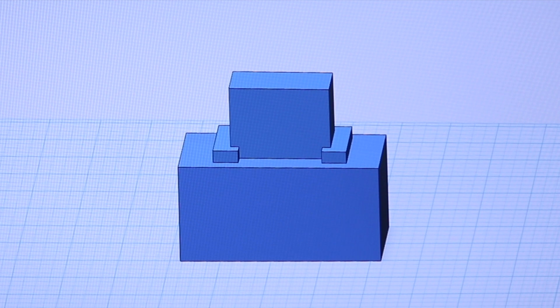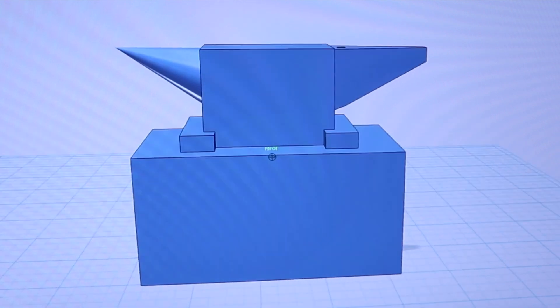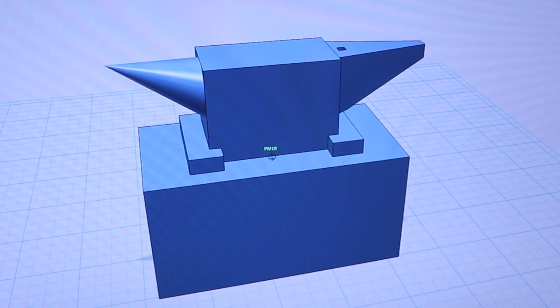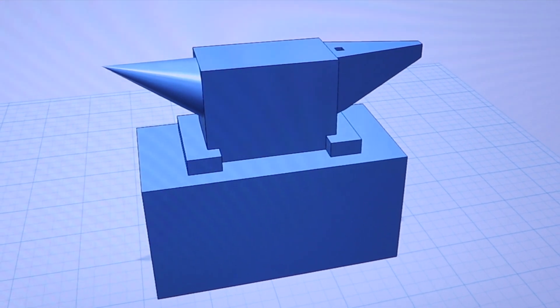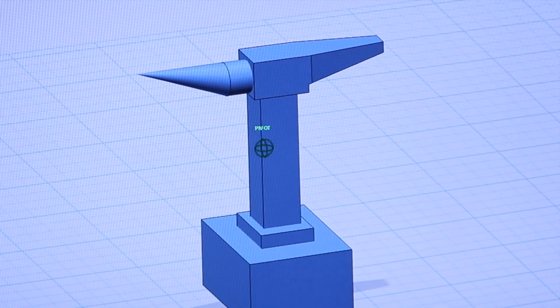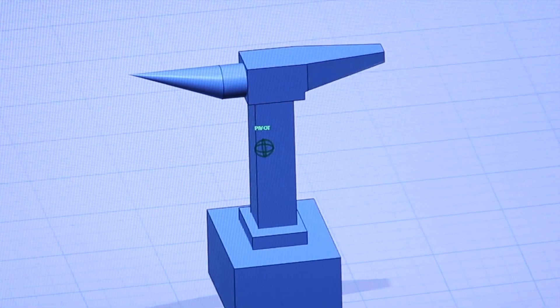Over the years there were quick advancements in technology and smiths were able to work with larger pieces of wrought iron and build more complex structures, so you started finding elements that were usually on stake anvils appearing on the main anvil. Even though these anvils start to resemble what we have today, they were still forging anvils designed for smiths moving a lot of metal. The body was still a big solid block — the horn short and stubby, the heel very blocky — and both horn and heel were buttressed back into the main body, making them extremely stable working platforms. A farrier, for example, would make shoes on the main anvil but still need a stake anvil to shape and fit shoes to tightly curved shapes.